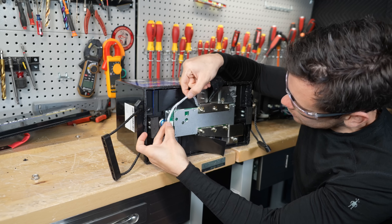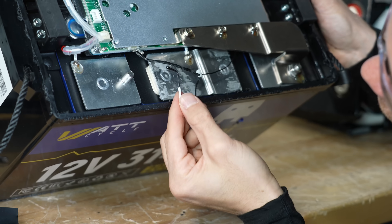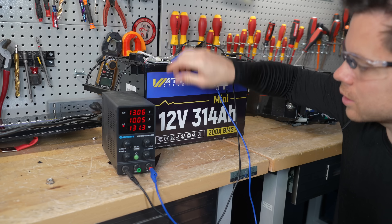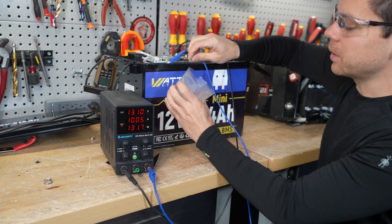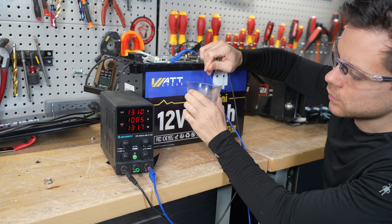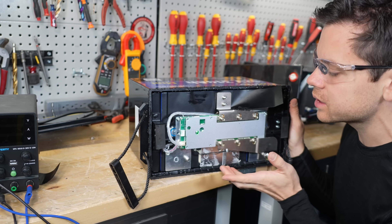The balance leads are protected. Where is the temperature sensor? Oh, here they are — and here's one, and the other one isn't coming off. Let's test this one for low temperature charging protection. We're charging with 10 amps. Here's some ice cold water — and it works. Let's warm it up. Works perfect, and the light turned on. I guess it was in a sleep mode.